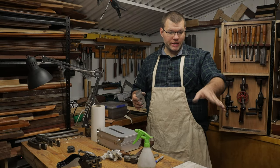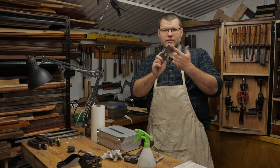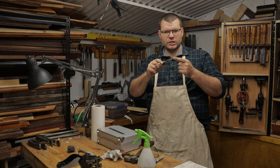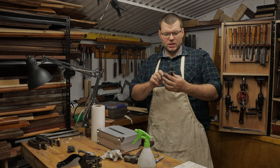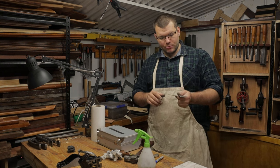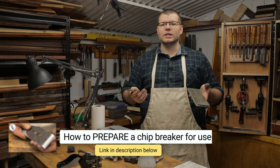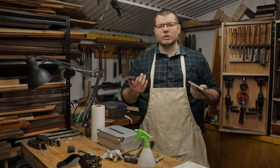So now the back of the blade is flattened, we need to now work on the chip breaker, and that requires leveling and flattening out the edge here, and also smoothing out the top here to allow the shavings to go up over the top of it. And we want a nice sharp edge, right on this edge of this chip breaker, and at the moment it's fairly blunt. So the first process I'm going to use is resting the chip breaker right on the edge of the stone. I've got another video which I'll leave a link below to where I went into more detail on that. So I really suggest you check that one out to get a really good understanding.